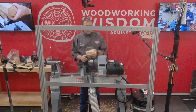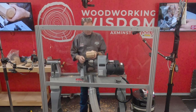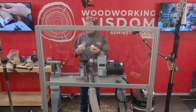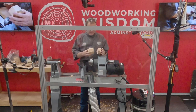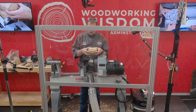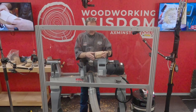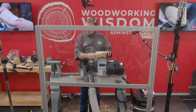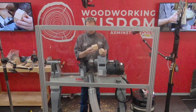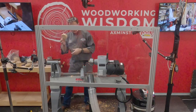Once you've done that, we need to separate the lid and base. That involves a special kind of parting tool — it's called a bandsaw. Much better to use the bandsaw because you waste less and you're not going to chip the corners. This is still very stable whilst you've got a flat on it — you can even put a G-clamp on if you wanted. My lid is two fifths and the base is three fifths.